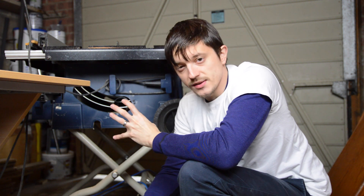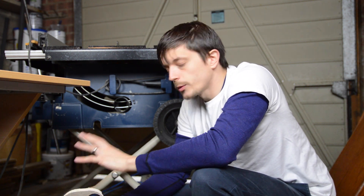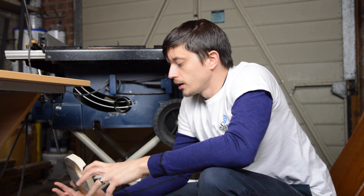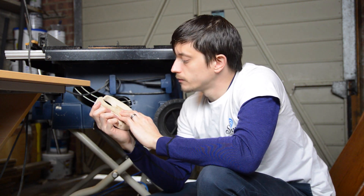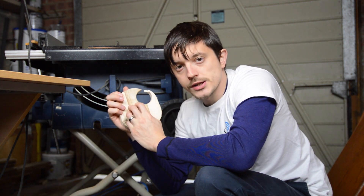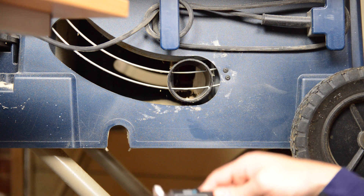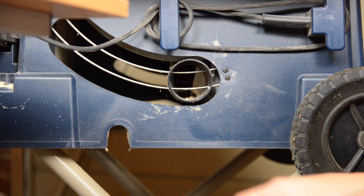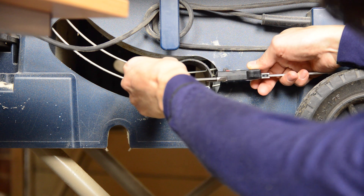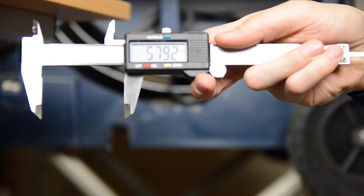It's not full size for a proper dust extractor, and it's not small enough for a shop vac. So what we need to do first is measure the inside diameter of this tube. I've selected a lovely piece of glued up pallet wood for the cutout. So we'll cut the circle and then make a smaller circle within that which will take the shop vac connection. Using a pair of digital calipers, we'll have a quick measure up of the internal diameter, looking for the centre most point of the circle. And we've got a reading there of just shy of 58 millimetres.